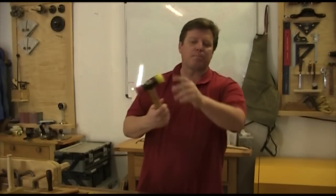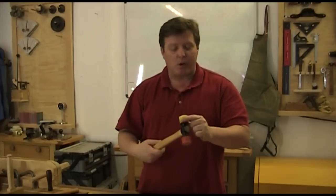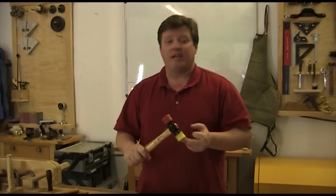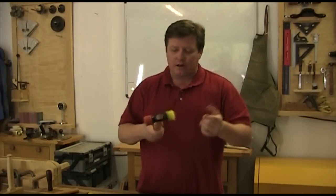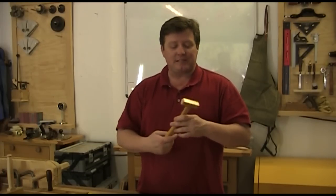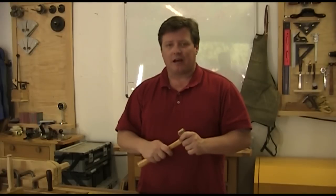We might consider a hard plastic, which combines a little bit of the density of metal, because we can tune plastic however we want in the modern day world, and it's a lot more durable than rubber. You can design it so it doesn't mar as much, but you have to have access to basically engineering skill to design the plastic you want and then to actually manufacture it. So there are pluses and minuses there. And once again, a lot of people love brass for mallets. You see brass mallets all over the place, because they are a little bit harder, but when you bang them into other metals, they will dent versus something like your blade, which is a lot harder.